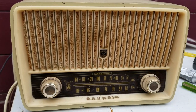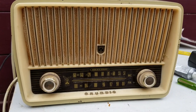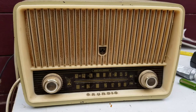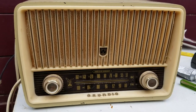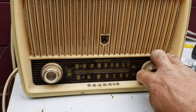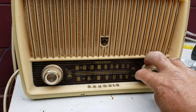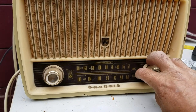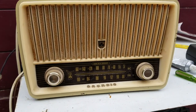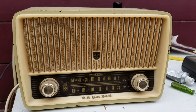Kind of quiet, it doesn't have a whole bunch of gain, but it works a lot better with those capacitors replaced — probably because the B+ is higher now that it's not loading it down with the tube biased on. It doesn't quite have the fidelity of the bigger models, but it's pretty good. Who knows how damaged that tube is from the prior owner — I don't even remember coming into possession of this.